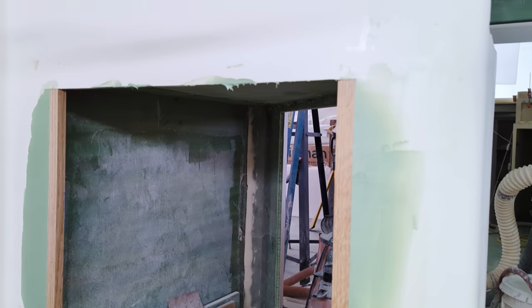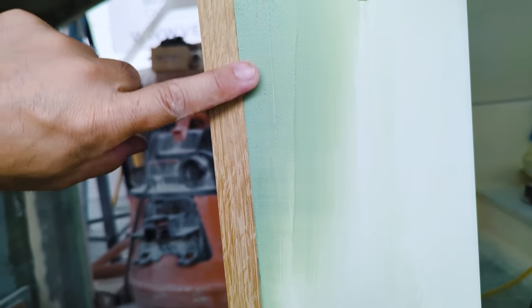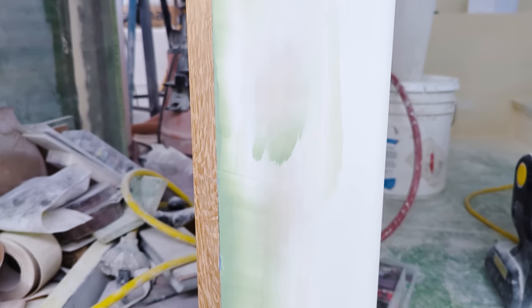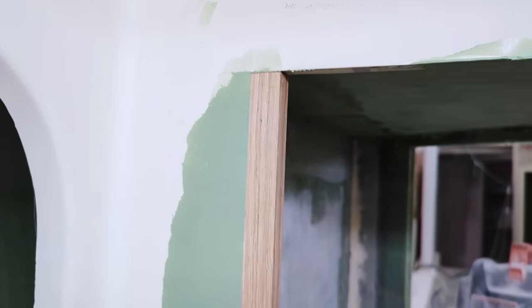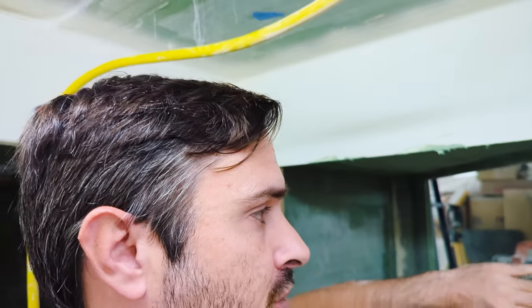This is day two now of our experimental area. Both of the pieces are bonded in place, and there were some slight undulations against that edge, so we filled it in with epoxy fairing compound. Now I'm going to go through and sand it, and hopefully not ruin all of the wood next to it — that's why we're doing it in this area, to learn from our mistakes where it will be hidden by a door. We'll attack this real quick, see how it turns out, and make sure we don't damage the wood by sanding this whole thing all in one piece.